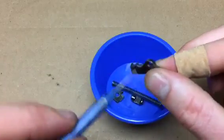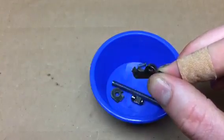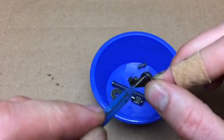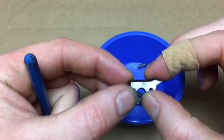And make sure, again, take a little sandpaper, roll it up tightly, put it in this hole, then chuck it in a drill and spin it soaked in polishing compound. Make sure this hole is smooth as glass. I want this extractor to pivot very freely on its pin.